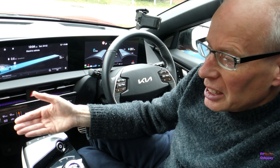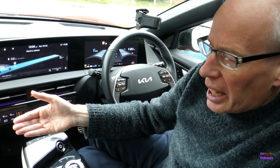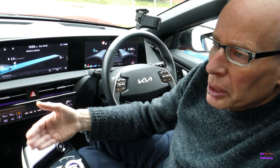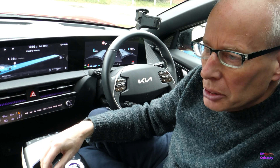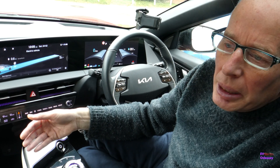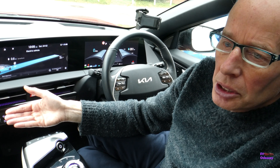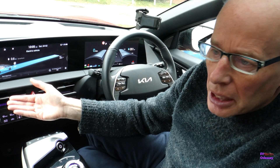I've tried TVs, hedge trimmers, lawn mowers, vacuum cleaners, hair dryers, coffee makers, kettles, portable induction hobs — you name it, I've tried it. Sometimes you can run more than one device at the same time if the load's not too much. It all depends on how many amps are being pulled. You can get away with 3.7 kilowatts if you're not pulling too many amps, but as soon as you pull too many amps it'll trip out the overload and you have to do the reset.